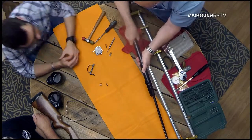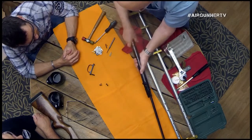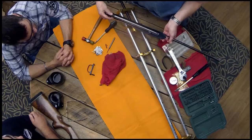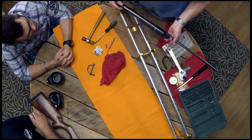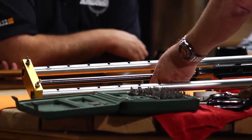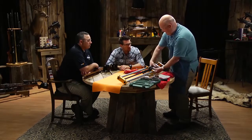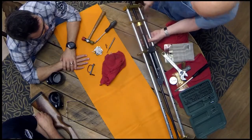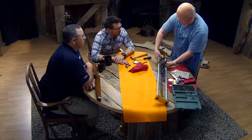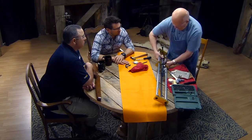Now look what's happened. The end cap has come out so far, you can begin to see the end of the end cap. Okay. But it's still got threads in there. Right. We're still safe. I've got about 3 good threads that are still engaged. Now it's time to install this in the mainspring compressor. Now I engage the muzzle. Now I'm putting a little bit of pressure on that end cap. Now what I'm going to do is loosen this just a little and unscrew the end cap. The people who made this made this piece right here that the gun fits in turn so that I can loosen this end cap and it won't get away from me. Okay. I just have to keep backing off on the screw. Right.